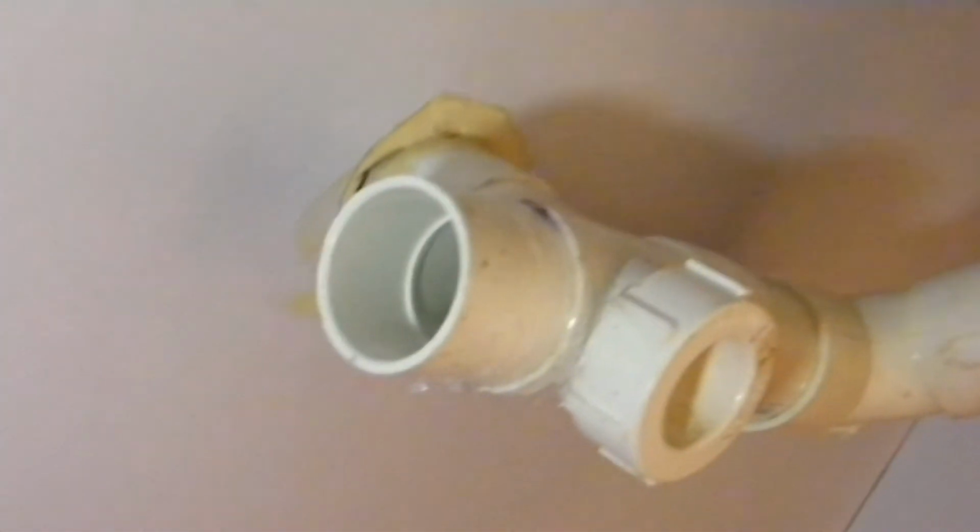And the pipe fits in there. It's got a standoff from the wall of maybe one pipe diameter. Let's see, I think it's close to a pipe diameter. It's not a pipe diameter. Yeah, it's about a pipe diameter. So that means it's going to be coming across this wall here, about one pipe diameter off the back wall there. So it might make sense to set it up so the trap gets connected on that thing there somehow, without putting too much strain on the pipe. And then the high loop will just drop into that drain and it'll drain correctly.